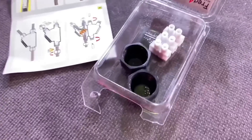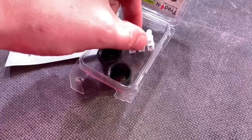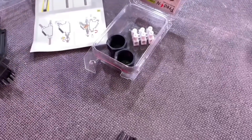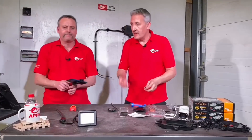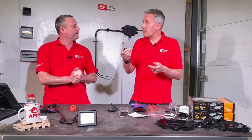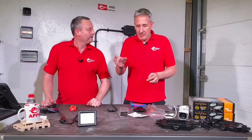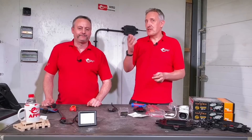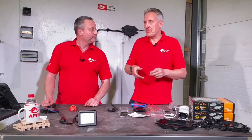It comes with some bits in the box — you have a normal connector, which people are immediately going to say they want to use Wagos. Watch out for an unearthed video on that to see if you actually can. It's also got these locking rings. You don't actually need a cable gland with this because the gel in the box itself is providing the IP rating. These are just for strain relief. The IP rating of the Fred is dual-rated: IP68, suitable for full immersion in water, and IP69, which covers hot jets of water — possibly for food environments or areas cleaned down regularly.